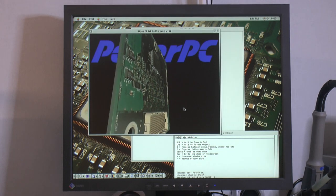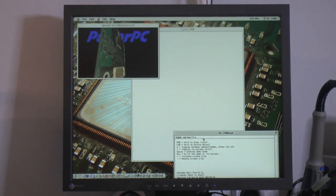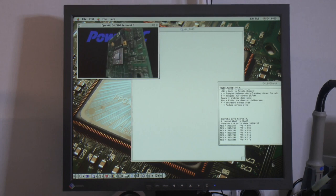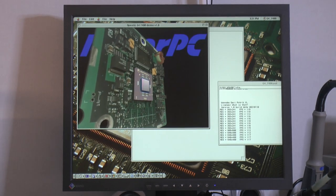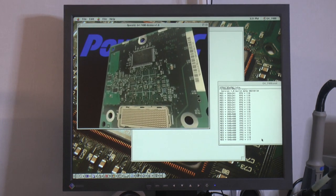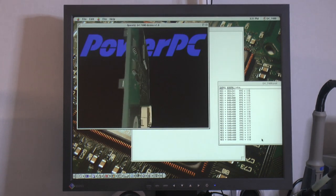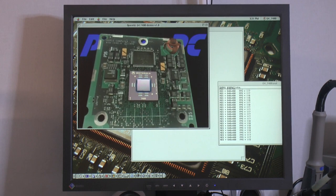You can press plus and minus to set the resolution, like how big you want the window, and you can also resize to anything you want, like so. And you can go into debug mode, which gives you the frame rate and the resolution. So now it's 640 by 480, which is what it starts up in. And we've got 117 frames here, 118, 117. With the old CPU, I had about 91 on average, sometimes up to 94. So 91 to 94, and now we're up in the 116 to 118. So yeah, it's a nice bump here too.